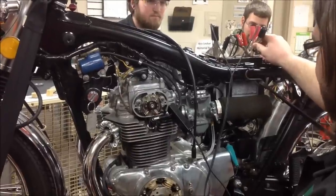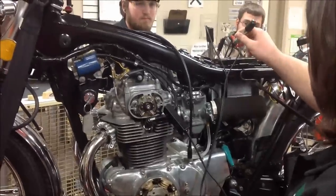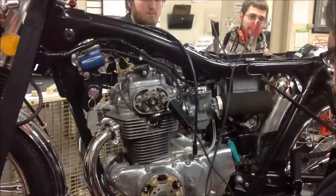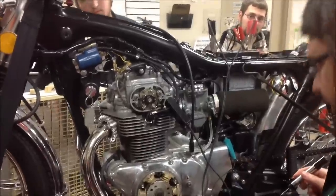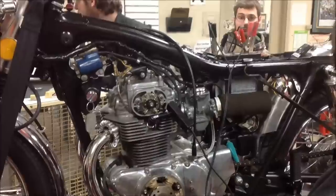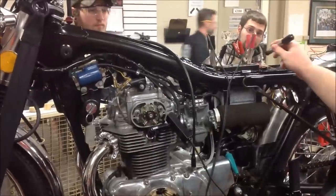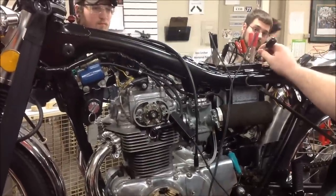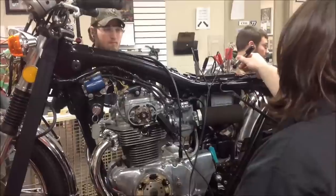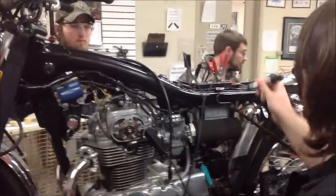Can we just do any live circuit? Yeah, so if you just wanted to see if you had voltage at something quick. A tool like this, its main purpose is just a real quick go/no-go — do I have power there? Do I have a ground there? I would find this to be extremely useful for ground testing. I wouldn't really think of it so much for measuring voltage going to a circuit, but to know if you have a good ground, rock on.